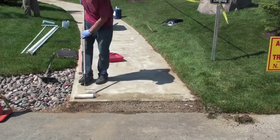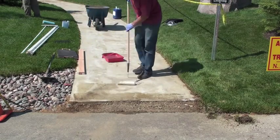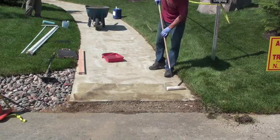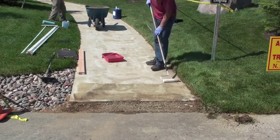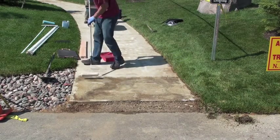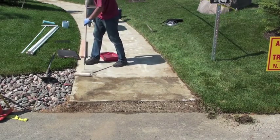We're going to start where the concrete meets the asphalt. We cut the asphalt and removed a little more than we're going to do as a layover. We stay about an inch over the concrete, and where the concrete meets the asphalt we dig it out about two to three inches. This will ensure a strong joining edge.